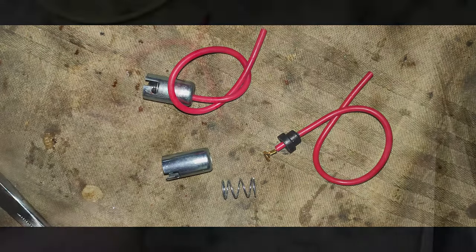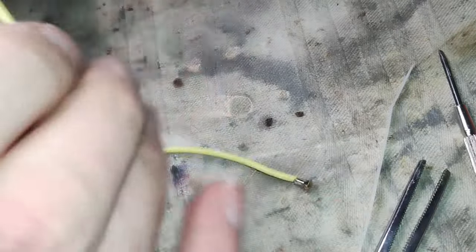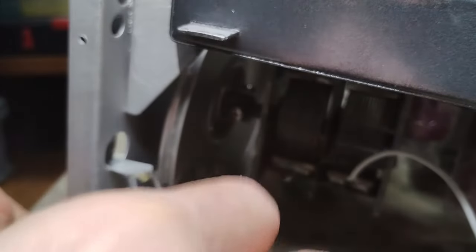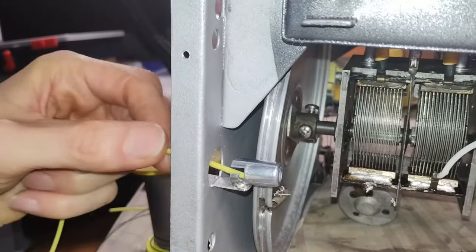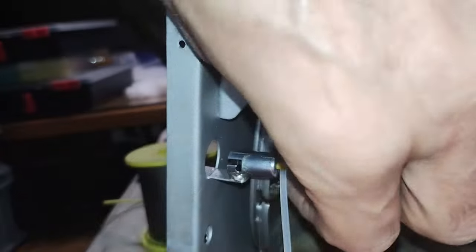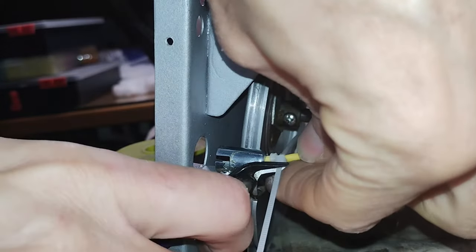The original pilot light sockets were severely deteriorated, and a decent replacement was not available for the restoration. Therefore, automotive bayonet sockets have been adapted instead, soldering them to the dial panel. Having fixed sockets makes the insertion and extraction of the light bulbs more difficult. Therefore, if original style sockets are available, they should be the preferred choice.